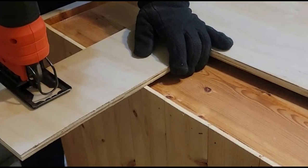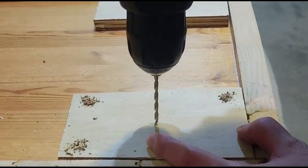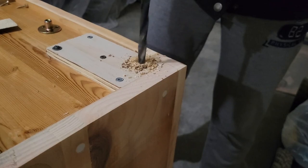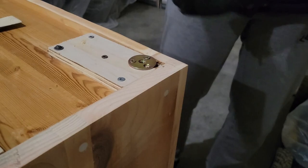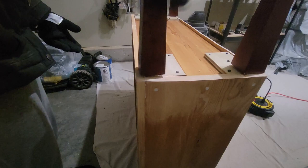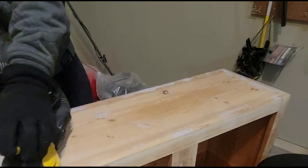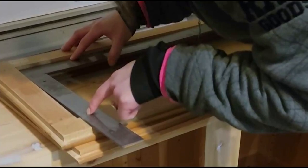Next up I flip the cabinet upside down and I'm just cutting some square pieces of wood just to bring the cabinet up a little bit, because there's about a half-inch gap. I'll be putting these underneath the cabinet and just drilling some pilot holes so that the wood doesn't split, then screwing them into the base. As you can see there's already a hole there — that's because I screwed up. I thought I wanted the legs flush with the cabinet but it didn't look right, so I'm drilling new holes and putting in the leg hardware. I'm using a leveler to make sure the cabinet isn't going to be wonky. Finally putting on the furniture legs — just make sure you're always measuring twice, cutting once. Now that I got the furniture legs on, I'm sanding the piece down with 220, just scuff sanding, which helps the paint adhere better. You should always scuff sand prior to painting — it's extra insurance to make sure your finish is going to last for years to come. I measured and cut the backer board with the jigsaw.